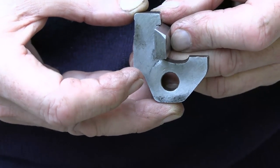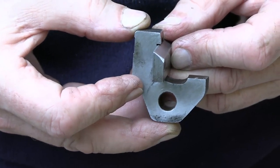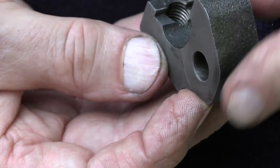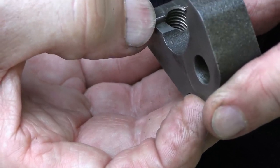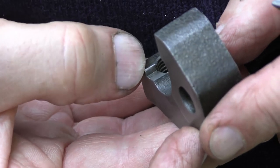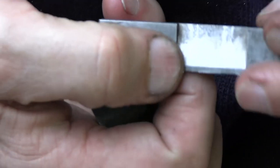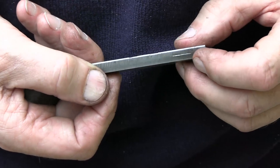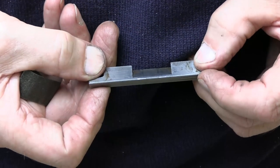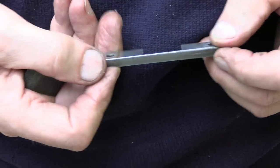I think this hook is only coming about that far and therefore it's not engaging properly, unless it can't come up any further - because the lever comes up against the edge of the aperture through which, in the case of the apron, the lever is operating. The top edge of this hook may be slightly worn, which doesn't help. One thing I thought was: if I were to mill half a millimetre off each side here, thereby bringing the ledge very slightly towards the hook - that might help.